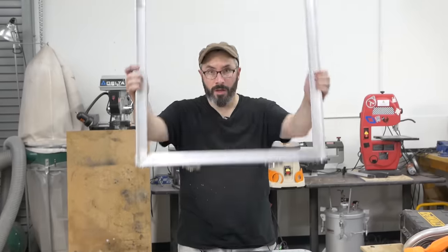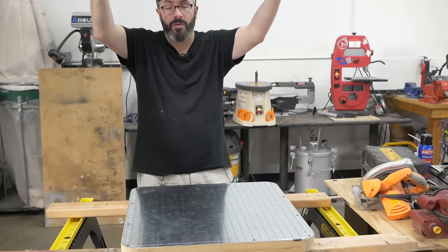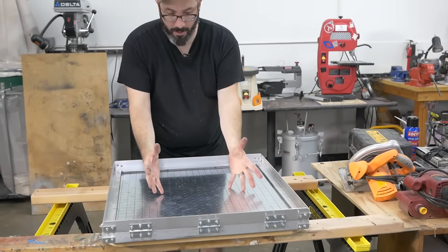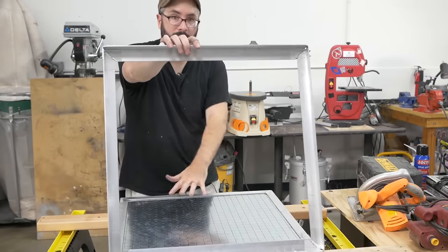Seems pretty good. Here's my frame. I might have to tweak it a little bit, but here's the idea. There's my platen. This will be held up to the heat with a piece of plastic in it. When it gets droopy, it comes down over a form, and then we pull the air out. And then we can just do this and take our piece out.